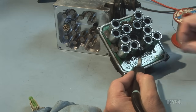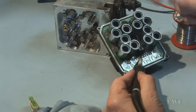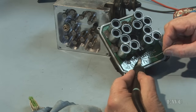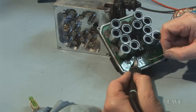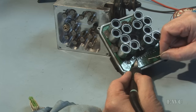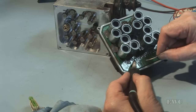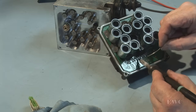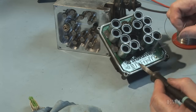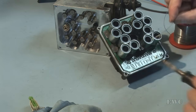Another way to make solder easier to undo is to heat up the item you are working on. Bring it up, say by sitting it on a radiator, which brings it up by 30 to 40 degrees, which means that's less work on the iron. It doesn't have to heat a small spot longer, reducing the risk of damaging the print.